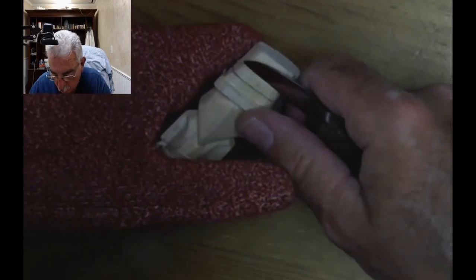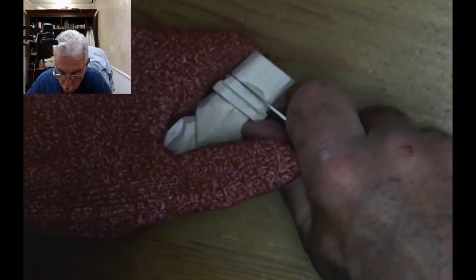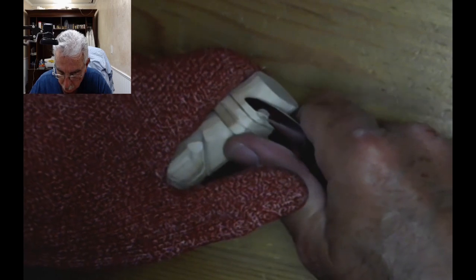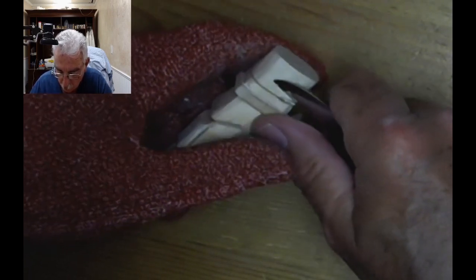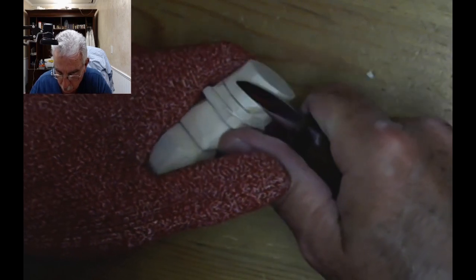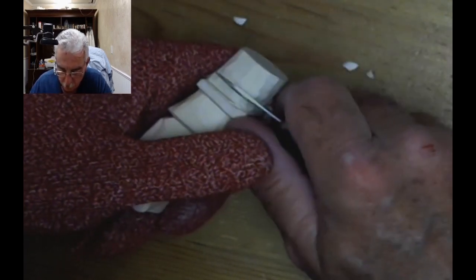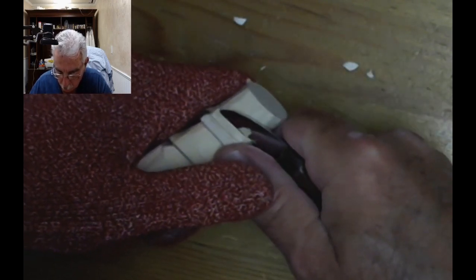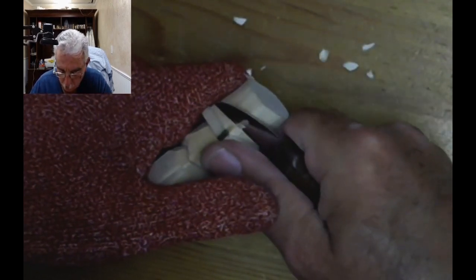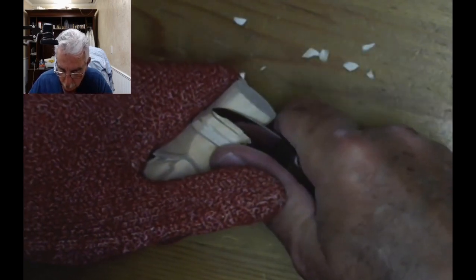Now I'm gonna go up just a little bit, maybe about an eighth of an inch. Come down, do an almost cut, rock it back and forth. Piece of wood came right out. Gonna do that same thing. You're just gonna take a slim sliver from up above down. Just take it nice and slow. Just bringing out that hat band. Nice and slow,